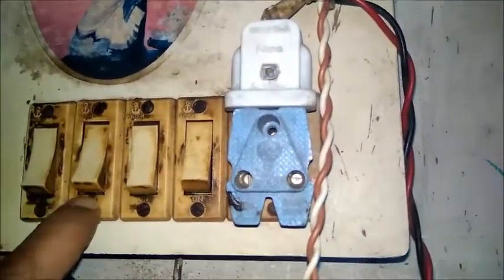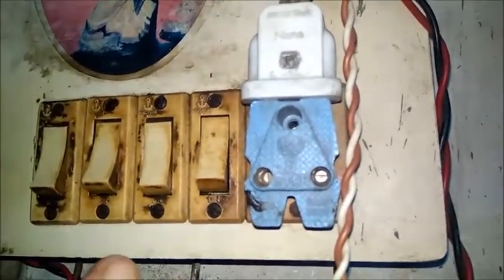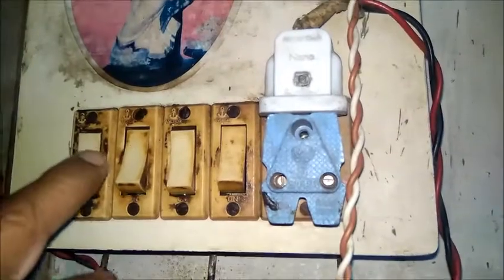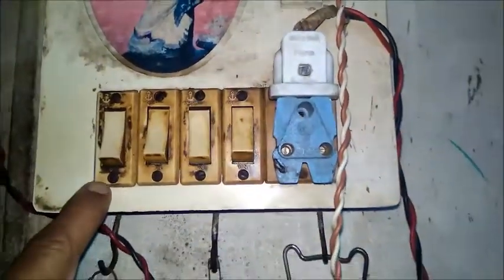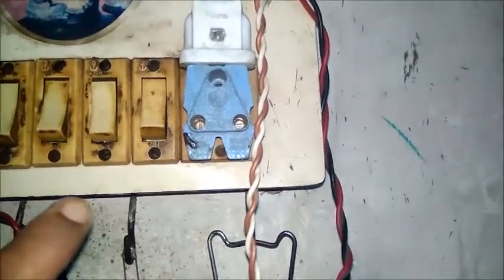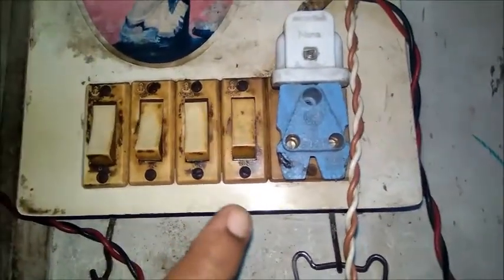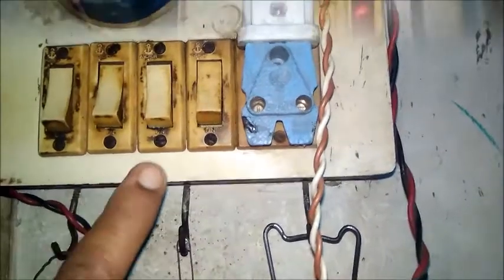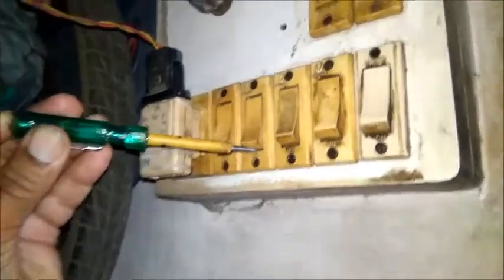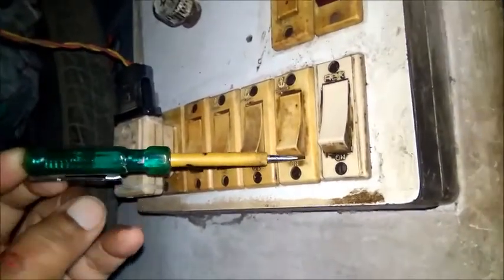You can do it yourself but you will have to be very careful. One very good safety precaution: wear dry, definitely insulating footwear before doing this work, so that even if there is some leakage or electrical conduction and it comes into contact with your finger, you should not get electrocuted. See — after doing all this maintenance and attempting to clear the leakage problem, the tester is not showing any light. That means the problem has been solved.